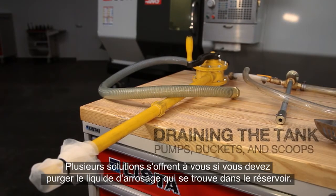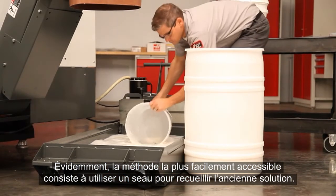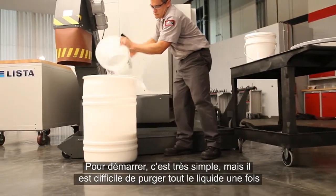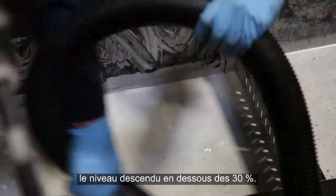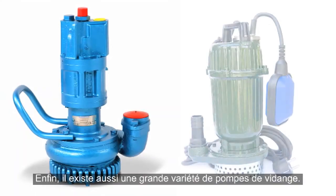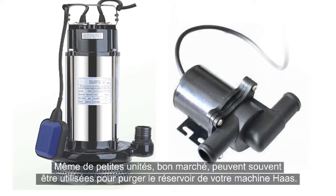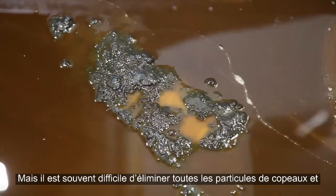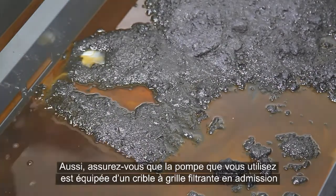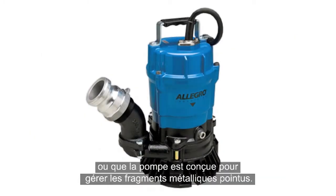When you need to drain the coolant in your tank, there are a number of ways to do this. The most readily available method is to use a bucket to bail the old solution out. This starts off easy, but it's difficult to get all the coolant out once the level is down below about 30% full. Some wet and dry vacs can be used to pump water out of a coolant tank. A wide variety of sump pumps also exist — even inexpensive smaller units can often be used to drain the tank. But it's usually difficult to remove all the chip particles and sludge before it's pumped out, so make sure the pump has a filter screen at the inlet or is rated to handle sharp metal fragments.